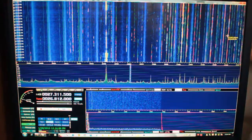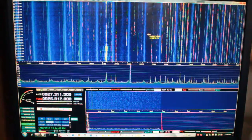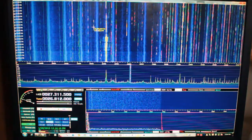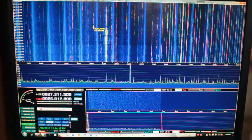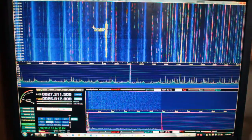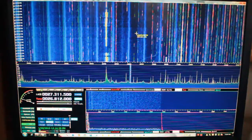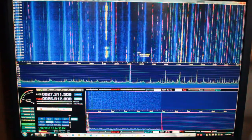The reason you're seeing so much traffic here relative to the noise level is because I made my own booster. If you want to do it, do it right. I live in a subdivision — I can't be putting up 200-foot-long wire antennas. So I made myself a little booster and ran 20 feet of 22-gauge wire around the ceiling in my Lanai for an antenna. Works very well. Look at that. Neat.